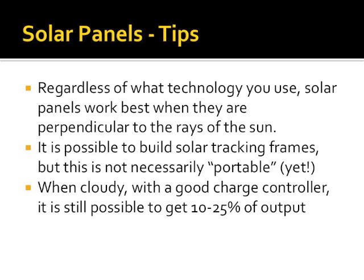Sizing. Assume you can get 6 to 8 hours of optimum sunlight. I tell you this because operating solar can sometimes be like operating QRP. The best of intentions does not make your operating day any better. Even though you may get, how long is a day during the longest day in the summer? Like 17? 15 and a half. Yeah. 6 to 8 hours is a good assumption for your operating, just to keep your expectations realistic. And plus, we'll get into this a little bit, but you also have to make sure you stay perpendicular to the sun.